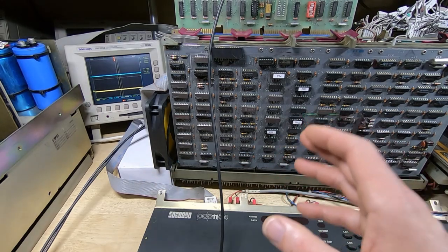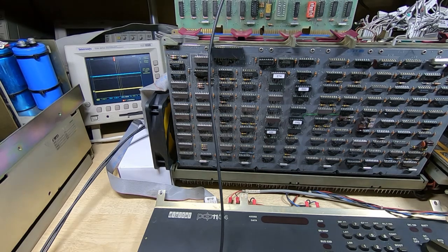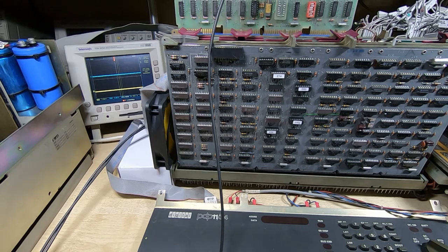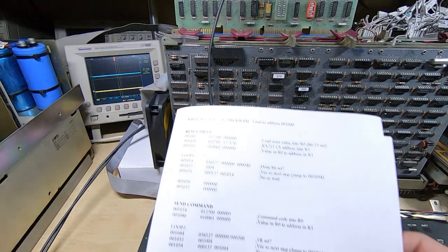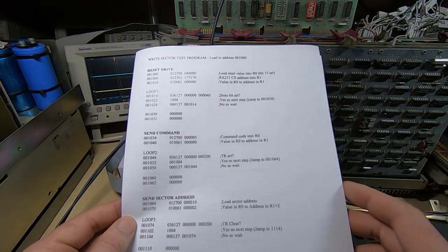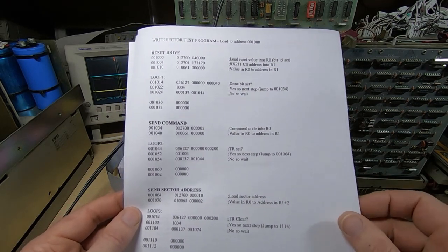Quite often you'll find that there's a single bit that's stuck somewhere and certain values don't work. But assuming it gets right through to the end of the test, then the first time it tries to write an invalid value or go to an invalid track, it halts, and you can see what the address was and how far it got. So like I said, the fault testing is as important as the valid testing, so it's something you do need to include in the testing that you're doing.